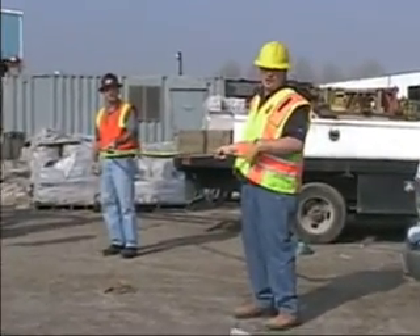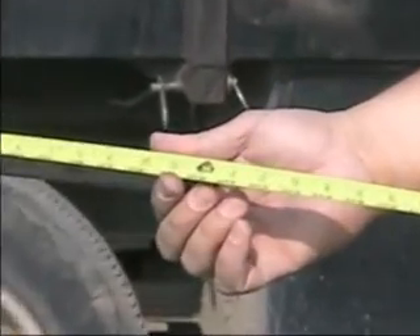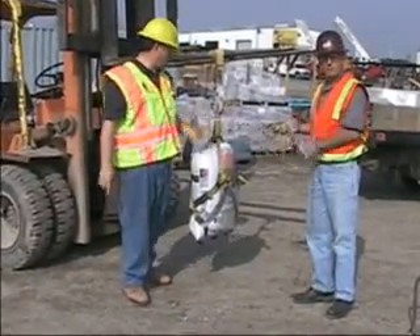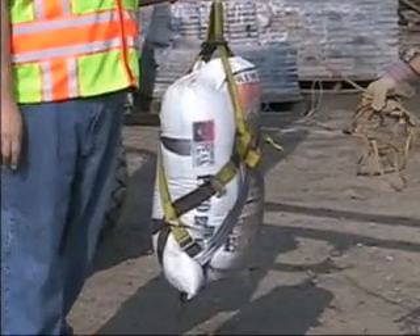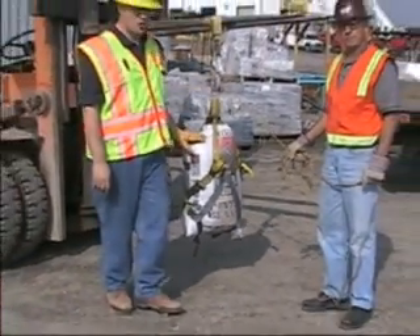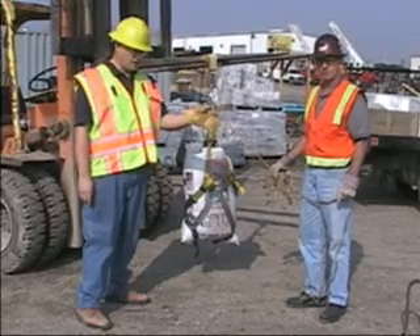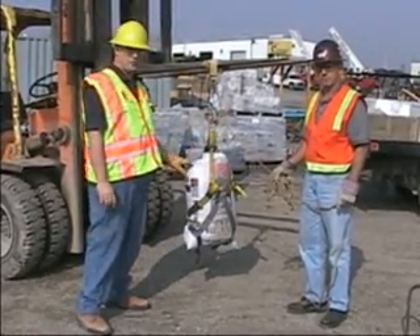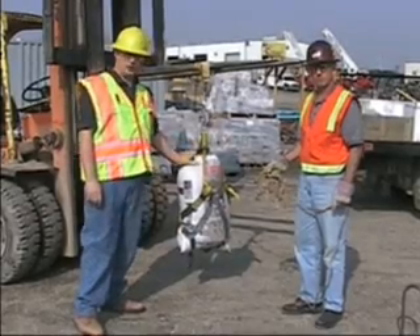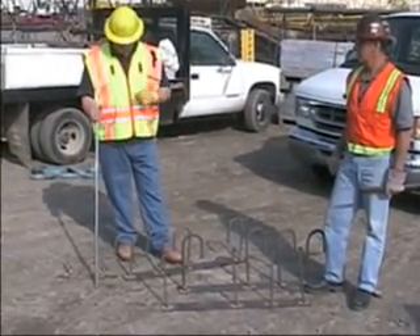It's going to be our measuring device — a 10-foot long piece of EMT. We'll be working at 10 feet. This is our test bag. We have sand that's less than 10% moisture content, rigged to a forklift using a nylon product and a quick release device. The test procedure will consist of raising this unit 10 feet off the ground, using the measuring stick, placing it over the sample to be tested. The rope will be pulled until the release and the sandbag will drop on the sample, and we will see what the results are. These are the samples we're going to test — we've got several varying things that we find on the job site.